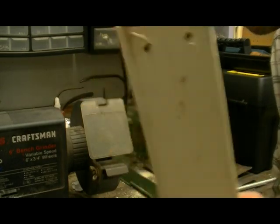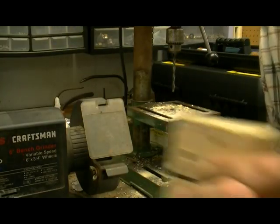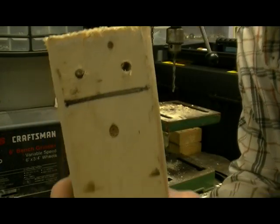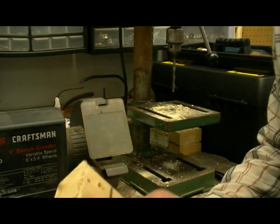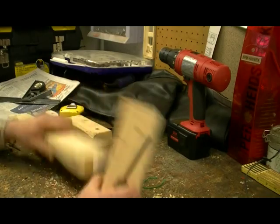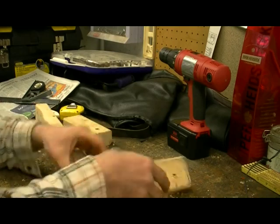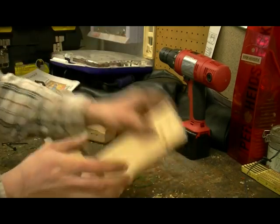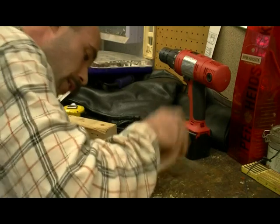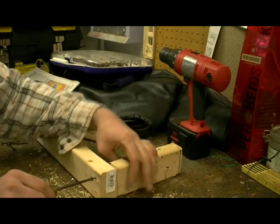The reason for pilot holes: as you can see, some of the wood is already cracked, and just drilling straight through would expand those cracks and make the piece useless. With pilot holes, you can drill through cleanly without that risk. Now get your screws, go through, and meet up the pieces — screw the leg piece into the main board.